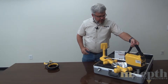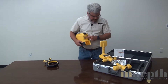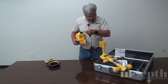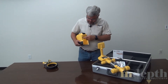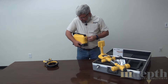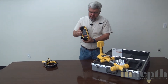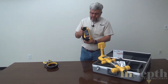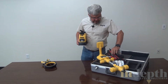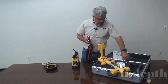With the transmitter — the transmitter runs on a lithium battery. You have your jack right here and you get a wall charger that plugs in right here. There's also a fuse, so if you accidentally hook it up to power, you can change the fuse out without the power flowing back into the instrument and blowing it up or burning it up. It has two power settings — low and high — and a battery indicator that shows you when you're at 50% or 100%. Here you have the jack where you can put your conductive leads in, where the red lead attaches to your target line and the black lead attaches to earth ground.